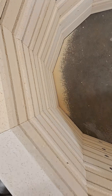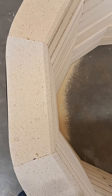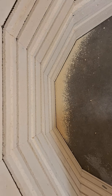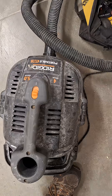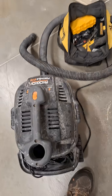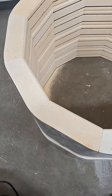I was able to pull the elements out and replace the bricks. These newer bricks that I put in here didn't match the new bricks on the new elements, so I then had to sand it down. As you can see, some of the debris is there at the bottom — I've already cleaned it up on the outside. That's where your shop vac comes in real handy. Get something with at least a good five horsepower surge on it and vacuum very, very well.